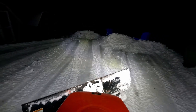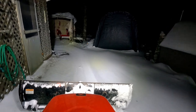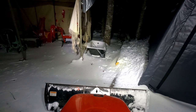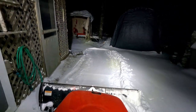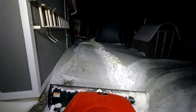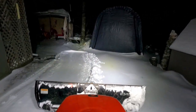So there we just finished clearing up that windrow. Now you see the windrow is still there on the left, but I had just made that cut through there and cleaned up the windrow on the right. So the last little while I'm going to keep the tractor in the shot. I had to go down now and clean up by the temporary shelter. The only way I can figure to do that is go in and back-drag with the blade. So I go in, set the blade down, and I put a little bit of down pressure on the blade just to make sure I scrape the snow off the ground well. Two or three passes here to get the bulk of that snow cleared.